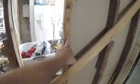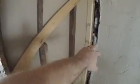So I wanna make sure that those are covered. So I'll have to have a drywall seam here and a drywall seam over there for a full sheet. And then on this side, it'll butt up against that one and come all the way across. So that'll cover both sides. And so that pretty much leaves me with putting a full sheet here all the way over. And then I'll just have to deal with that corner with, you know, a small piece like what we already had there. And we'll just have to make it work.